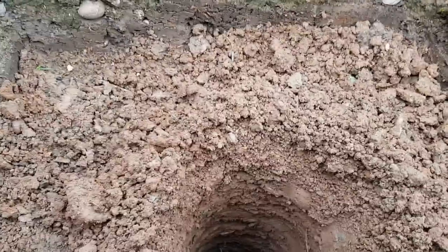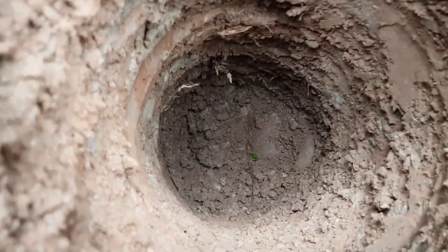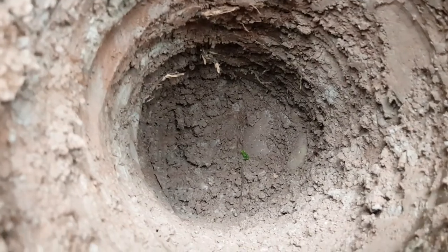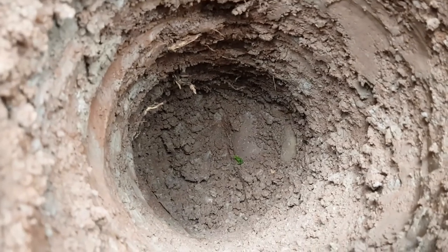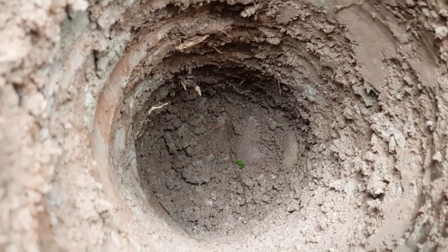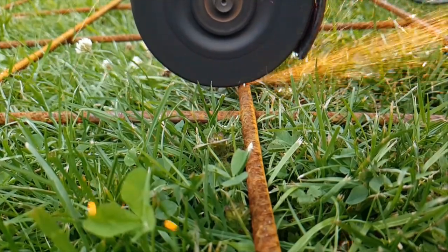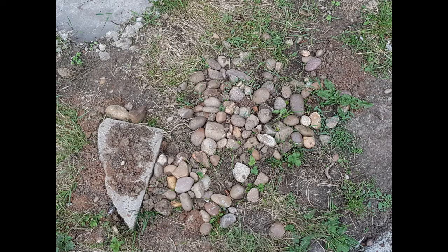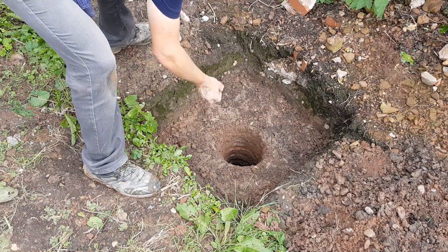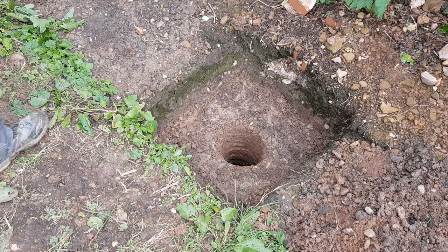As you can see from this clip, the borehole walls are very rough, which is a good thing as it creates more vertical friction with the concrete. I was lucky enough to find two very large boulders at the bottom of this one, which I decided to leave well alone. From Selco, I purchased some rebar mesh and cut it to slightly less than 300 by 300mm so it would drop into the concrete. I collected as many stones as possible during my excavations and then added as many as I could to the base of each hole. These were then rammed in to stop any settling.